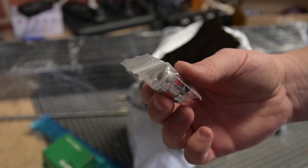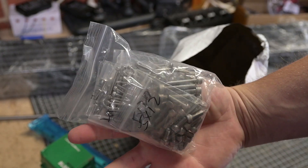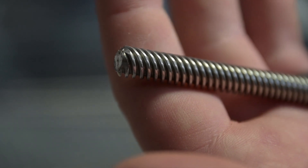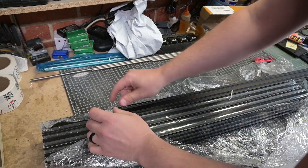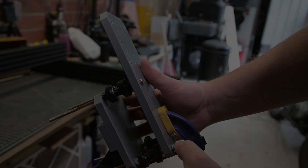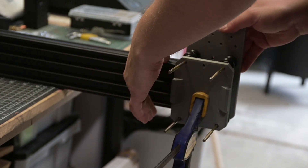This build will necessitate a lot of parts, and some which will probably change over the course of the build, so I'll put everything I use in the listing description. The highlights are the T8 lead screws and 8040 aluminium profile. The beauty of using aluminium extrusion in a variety of lengths is that this machine's cutting area is infinitely configurable. The carriages will all look something like this, with 8 rollers engaging on the profile.